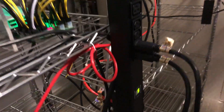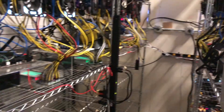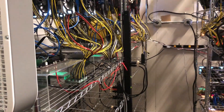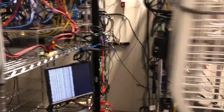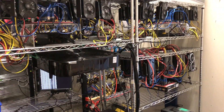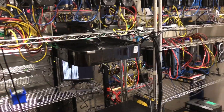Right now I'm kind of playing around with the amp loads. I have the seven 1070 Ti's on the upper bank and it just came online pulling about five amps. Down below the Ant Miner by itself is six amps, so I could put both of those on one bank. Then I could potentially put 13 RX 580s on the other bank, although I suspect that's going to be pulling more than 50% of my allowance. I do have another metered PDU to put in, and all in, this will give me a better sense of where I can expand — add a card here and there to rigs that can accept additional cards to the M.2 slot or wherever, and possibly shuffle things around to get maybe another rig in here.